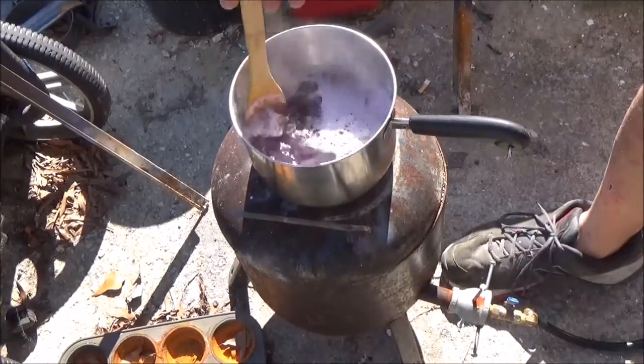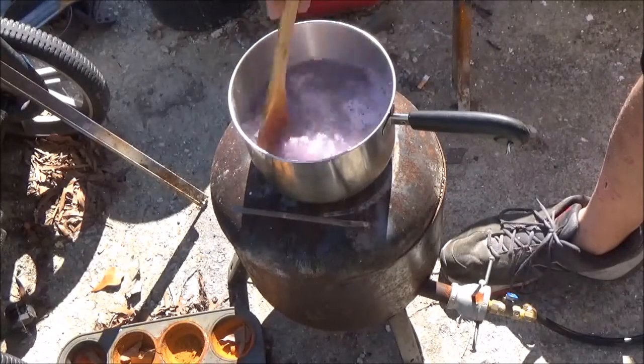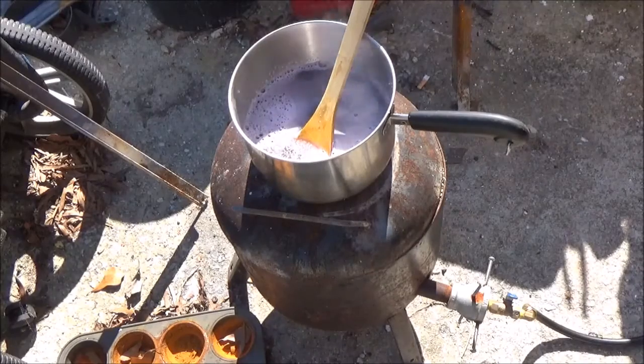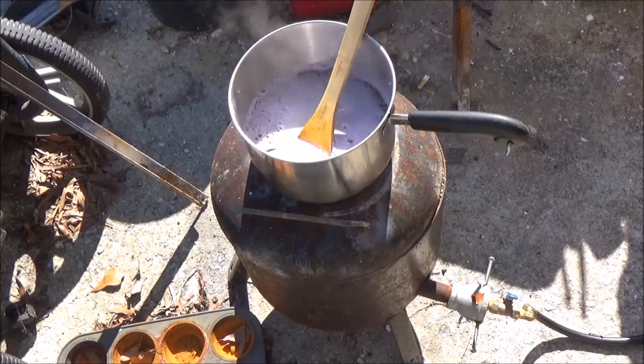It's still kind of thin, but I'm going to thin it out anyway when I put it in this milk jug. You want it to be as full as you can so it doesn't harden up in the jug. So we're going to let it cool off and then pour it in. That's how you make sodium silicate gel so that you can make your own molds with sand. You can use it as an adhesive if you leave it nice and thick — it will adhere two pieces of steel together nicely. People also use sodium silicate to seal head gasket leaks in their car by putting it in their coolant. But that's the 411 on it.